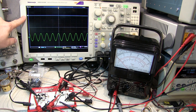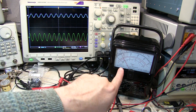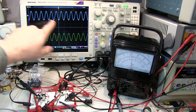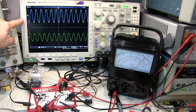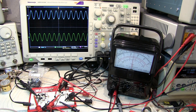With the tail current at zero, our gain is zero. As we start turning the tail current up, we can see some output beginning to appear. As we increase the tail current, we can see the output voltage increasing. It's a very simple demonstration of how the small signal gain of a differential amplifier is a function of the tail current, or the bias current through the transistors. On its own, having an electronically controlled amplifier can be very useful for things like automatic gain control or electronically adjustable volume controls.